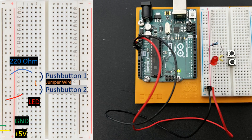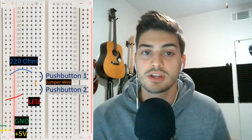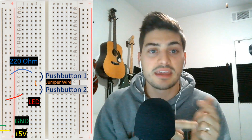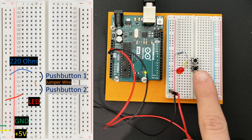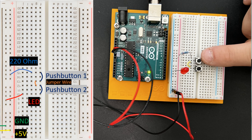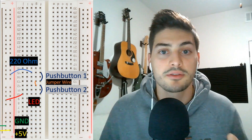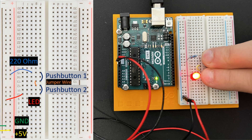To add a second push button in series: for the LED to get turned on — for electricity to get to the LED from our power supply — we need this push button to be pressed AND this push button to be pressed. The conditions are additive, and there is no other combination of these switches other than both being pressed that will lead to the LED lighting up.